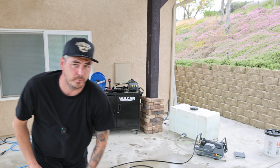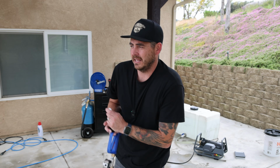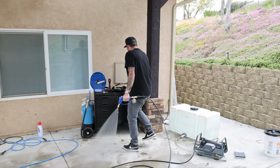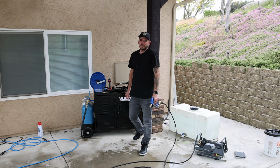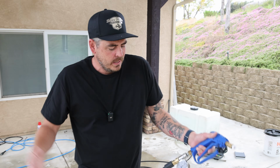Let me go to, what was this, 3.5? Let's go to a 4.0. Okay, so here's a 4.0. You plug that in and test the amperage with that one. Again, we want to stay under that 15. Nope, we're just above it. We're at 15.4, and then it settled down to about 15.2.